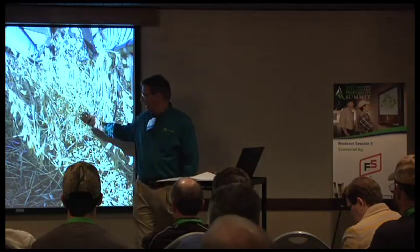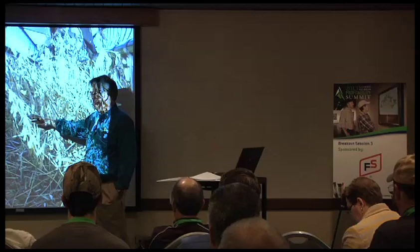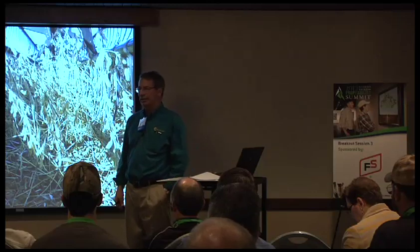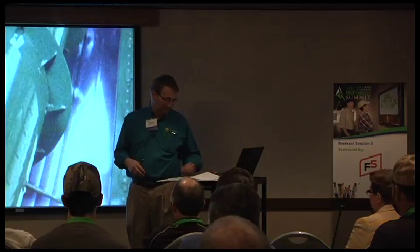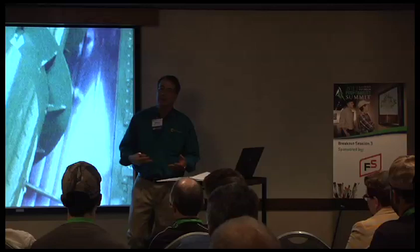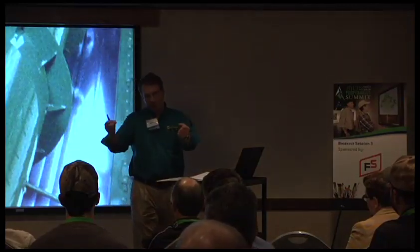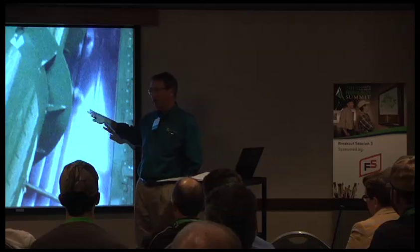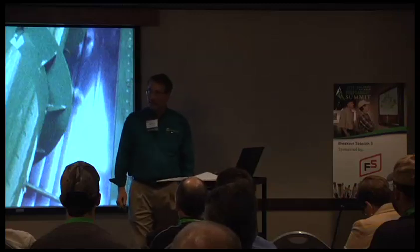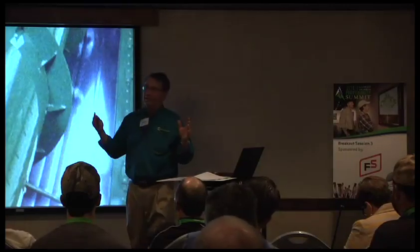Late at night or on foggy days I always have a little trouble in no-till getting the corn stalk residue across the sickle and into the cross auger. John Deere has done a nice job — they have a full-fingered cross auger with retractable fingers across the entire length that reach out, grab the material, and pull it in. They also run a stainless steel tray and I really like that. We're interested in getting that material from the sickle to the auger as quickly and smoothly as possible.